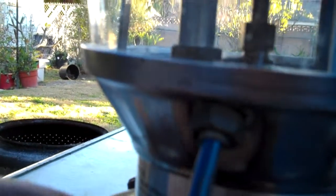The other thing is, I was thinking maybe it's possible that this part that wears against the wheel, that wears against the flint, maybe not 100%, but you'll get a spark out of it once in a while, but I can't get one right now. And what's happening also a little bit is this wheel is backing off a little bit, so if you go in here and tighten it a little bit, you'll get a couple sparks. So anyways, he installed it.